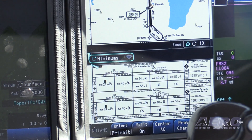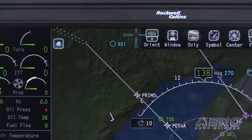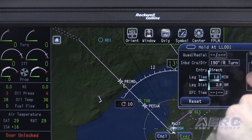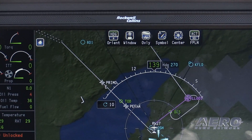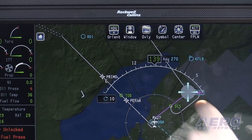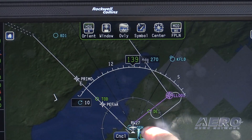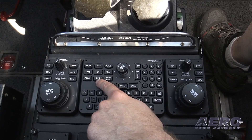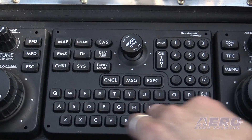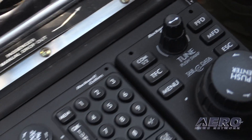It's a great question, and we've combated that in a couple of different ways. First, we have a specialized bezel around the screen where you can anchor your hands, so if you're in moderate turbulence your hands aren't bouncing around and you can touch exactly what you want. Second, we've addressed the screen architecture itself — we've used what are called resistive touchscreens, which means you have to press the screen with some deliberate force to get it to engage. A lot of people are used to their iPhones or Androids with capacitive touchscreens where if you accidentally touch it, things go all over the place — not so with Fusion. And the last way we overcome that is with the utilization of all the keypads and joysticks on the bottom. So if you feel that's easier in turbulence, you can use that. There are really three big ways this works in turbulence, and we haven't had any complaints about it.